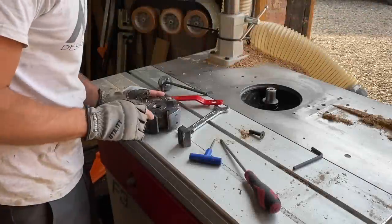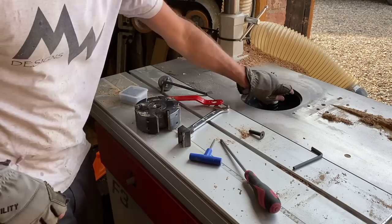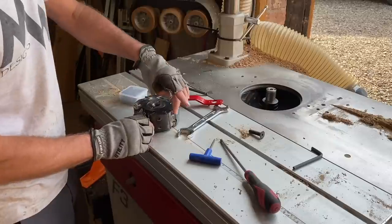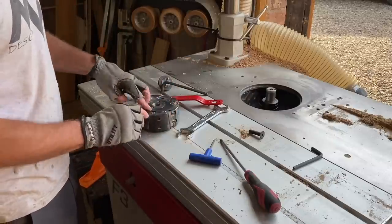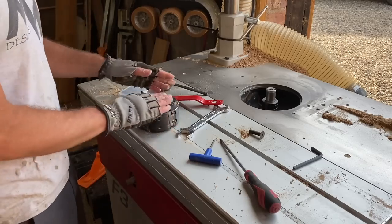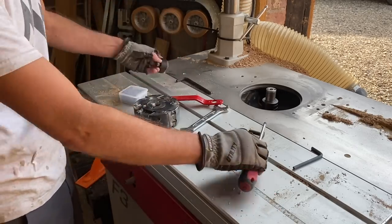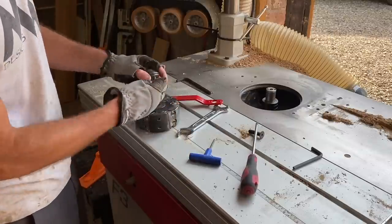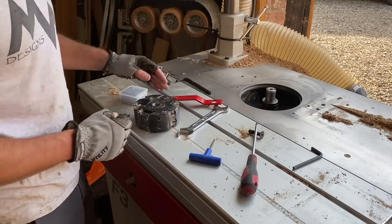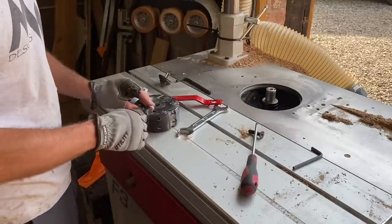This is the multi-purpose block — 125 by 175 by 55, with a 30mil hub or spindle on the motor. It has built-in cutters, so when you buy it, there's a spacer in here, a set of cutters, and a top cutter to give you a nice clean cut. I make my tenons on that by just going across it. It comes with a very low-profile nut compared to the original one on the Felder, giving you completely flat clearance so you can go over the top of your tenon — last tenon I did was 110mil.